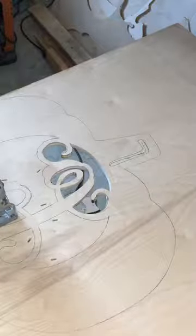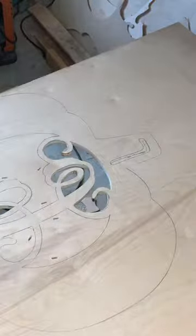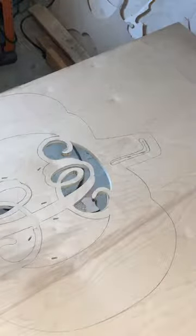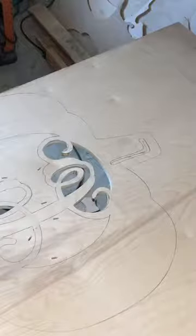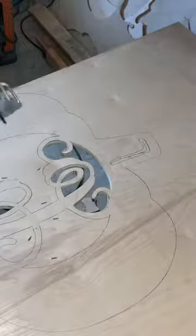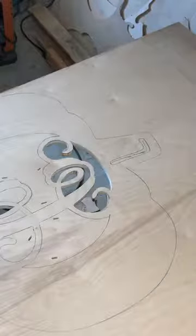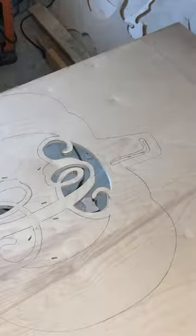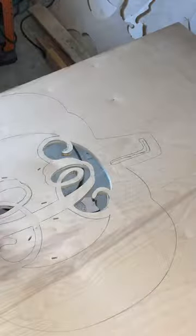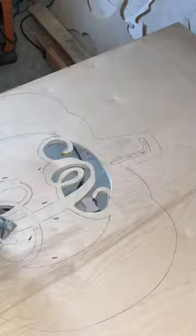Without breaking a blade. Miss Kathy, that's why when you get your blades, make sure they are the scroll cut blades. I love Bosch. I like the Bosch 20 TPI, and TPI means teeth per inch, and I make sure that I get a T-shank. So the blades have everything to do with making sharp turns.